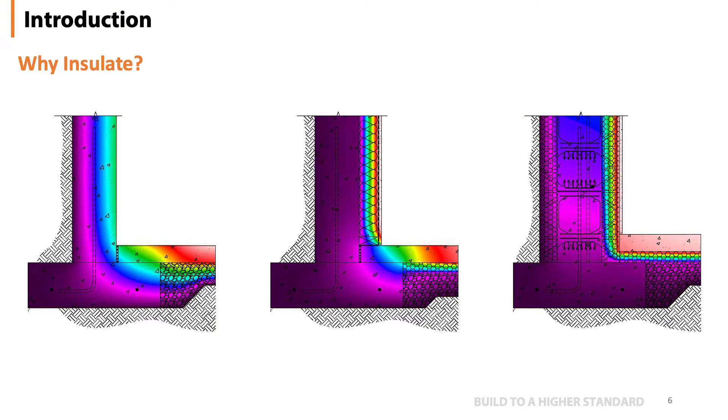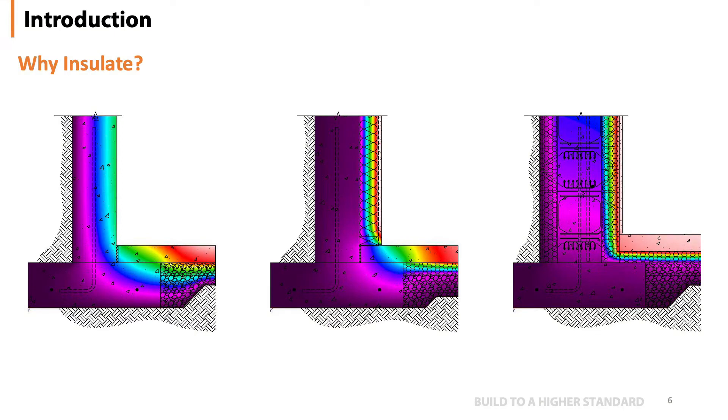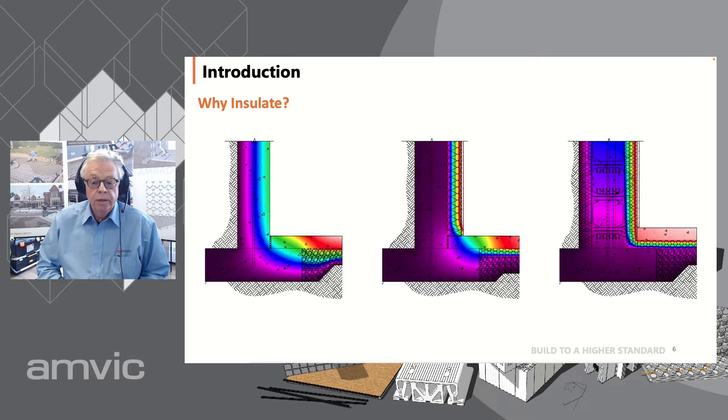On the right you see a fully insulated and finished foundation with the proper location for the under-slab insulation. What you're seeing here is a thermal gradient overlay on top of the details from the previous slide using a heat transfer analysis software. The darkest purple is the coldest temperature while the light red color is the warmest. In the middle diagram you can see a large area of green color which roughly correlates to about 10 to 15 degrees Celsius. The diagram on the right shows a fairly consistent light red color correlating to approximately 20 degrees Celsius, which is much warmer. This comparison shows the impact of adding insulation under your slab and that proper insulation techniques are crucial as they impact the occupant's thermal comfort, floor surface temperature, energy efficiency, and heat loss around the perimeter.